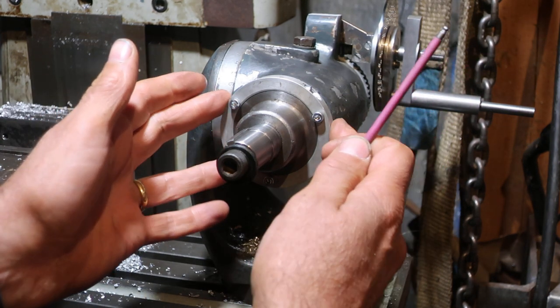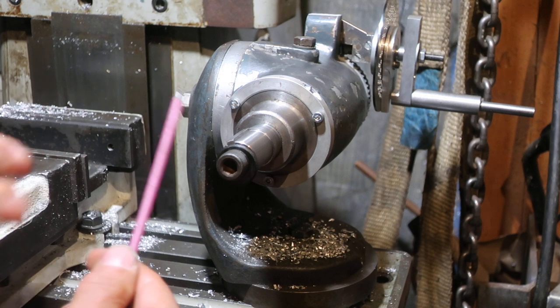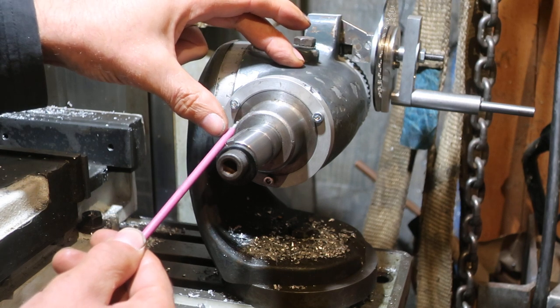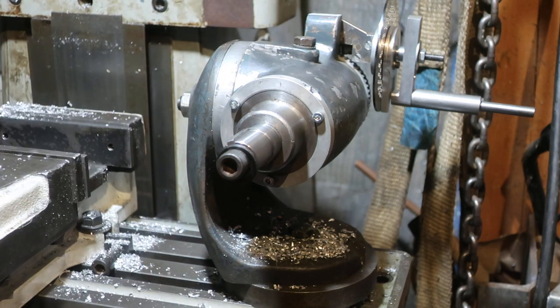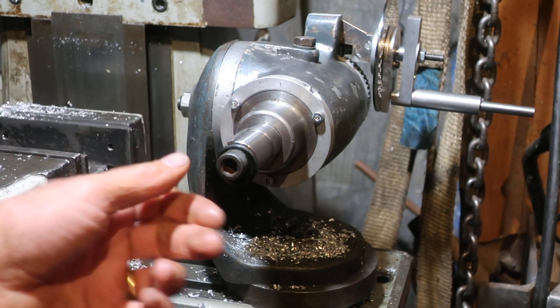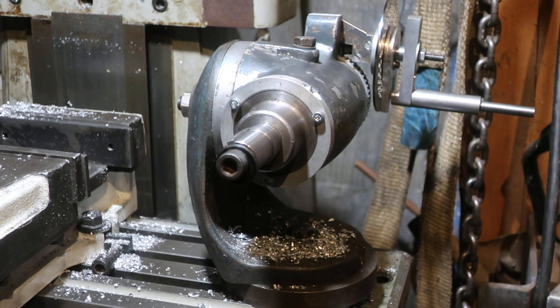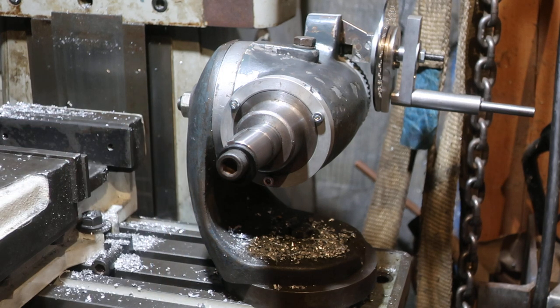So what we've done here is we've taken this horrible aluminium ring, which I'm going to remake in steel, and bolted it onto the front of the housing. I'm going to remake it with a slightly smaller internal diameter, and turn this down a little bit more, so that I can counterbore the heads of these bolts in. So that's a fairly tight fit. It's not quite a tight fit, but there's probably, I don't know, 3/100ths or thereabouts, given the effort I had to make to push it through.